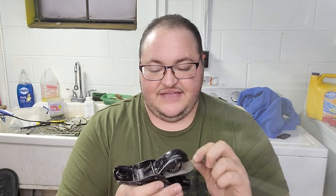It did. It did a little bit better on the end grain than I thought it would. The biggest difference, there's two things with the Stanley that I want to point out. So, I felt like I kept having to adjust the iron. I felt like the lateral would go out or the depth of the iron would back off, like it was getting backlash. And this thing is so tight, I'm worried that if I tighten it down any more, it's going to break. So I definitely don't want to do that. But that was one thing that was annoying, is it just kept getting out of whack and I kept having to fiddle with it, especially when it came to the end grain.